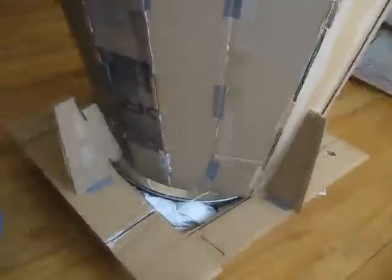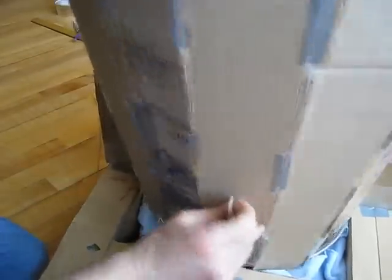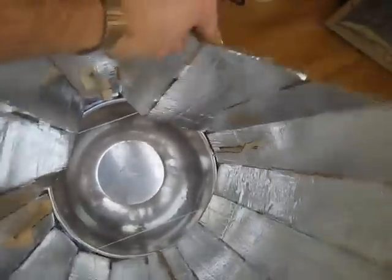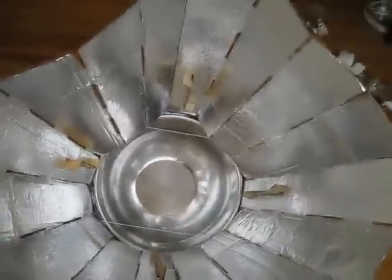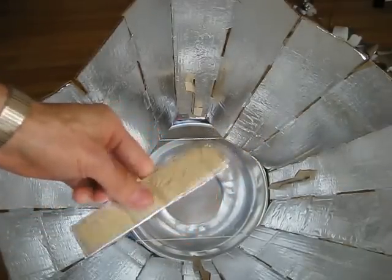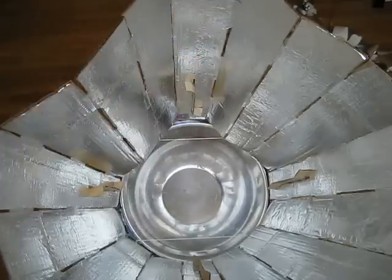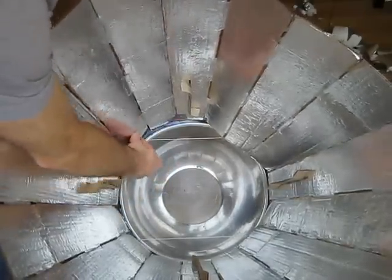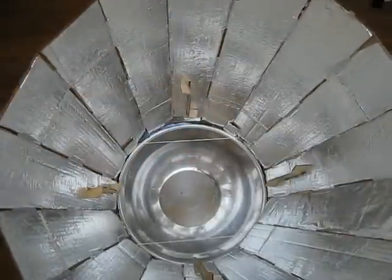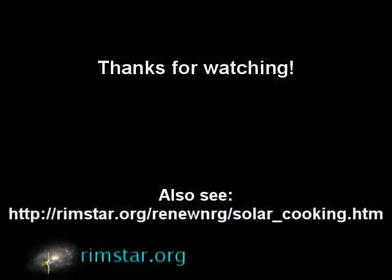There's one flaw in the plan — the unsupported parts here droop inwards. So I needed a hack to fix it, and I found an elegant one. I took some pieces of cardboard, wrapped aluminum tape around at least one side, and simply wedged them between the bowl and the insulation. And there we go. Thanks for watching — click here for part four, which covers the design and construction of the cooking table used to sit the jar on in the solar cooker. And if you missed seeing the solar cooker in action, click here for part one.